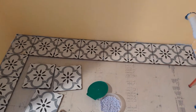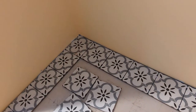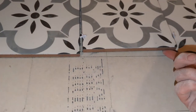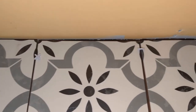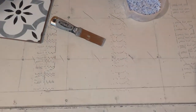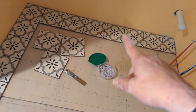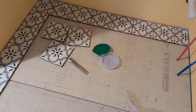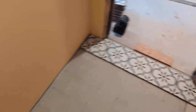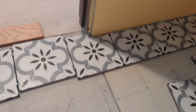That means I need to know how it's going to go before I start. I want to make sure these tiles stay square to this wall back here. I've already checked that the walls are square — that it's the same distance. I've drawn a line for the first row of tile, with a little gap back there to allow room for error. I've also drawn a line right here that is exactly 34 inches from that back wall, and I've verified it's square to this wall, so as I lay the tile I can measure down and check its distance to this line to know I'm staying square. I've also drawn a line along the whole edge of this tile so I can make sure the tile is laid square.